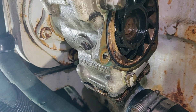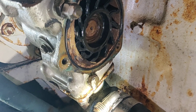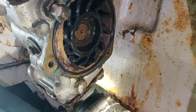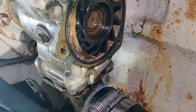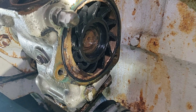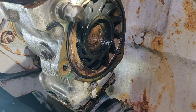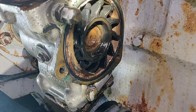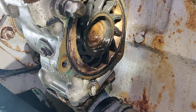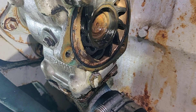What I was trying to show you is two things. First of all, to break the seal of the rubber vanes against the metal or bronze housing, there's a couple ways to do it. You spray some lubricant in there and Seaboard Marine tells you to bump the engine over. Well, if you do that with this engine, it'll start right away, and that's not what I want. So instead what I do is put a 15/16 socket on a half-inch drive ratchet and turn the alternator.